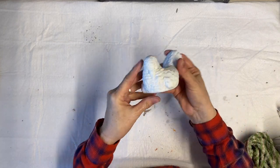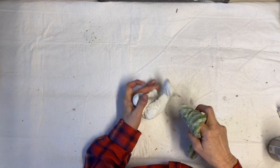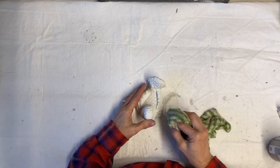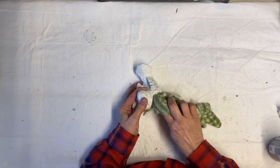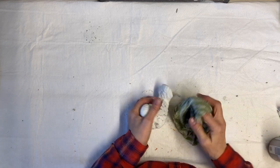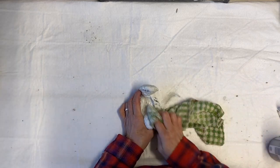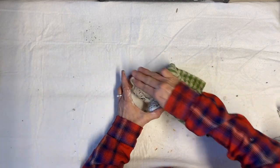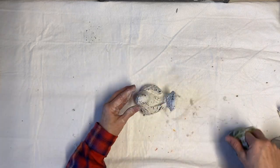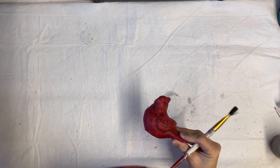Let the chalk paint dry and put another coat on. I don't need to clear coat after the white, because now I'm taking a damp cloth — you could use a baby wipe — and very lightly wiping across the high parts. It takes that chalk paint off easily. Chalk paint is very easy to distress with a wet cloth. I wouldn't really recommend sandpaper here because the chalk is so soft and you could easily sand down too far. Once it dried, I clear coated it to seal in that chalk paint.